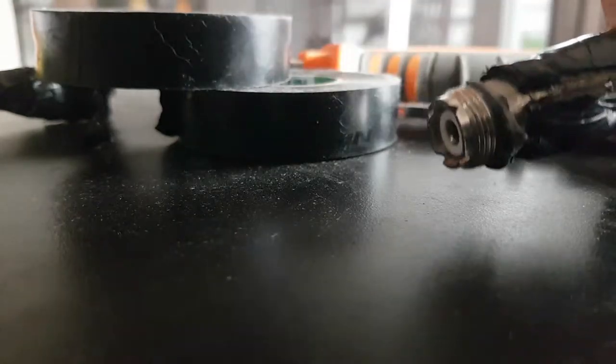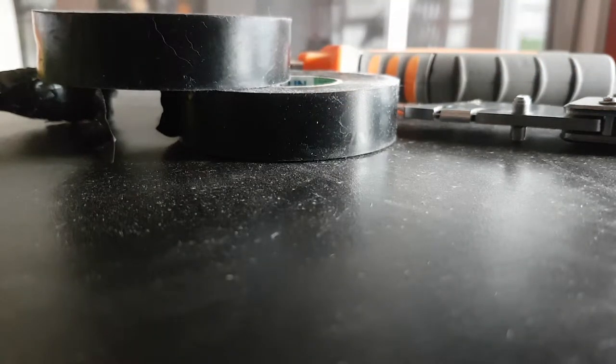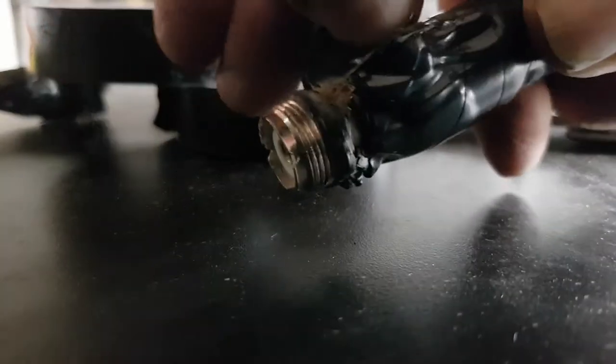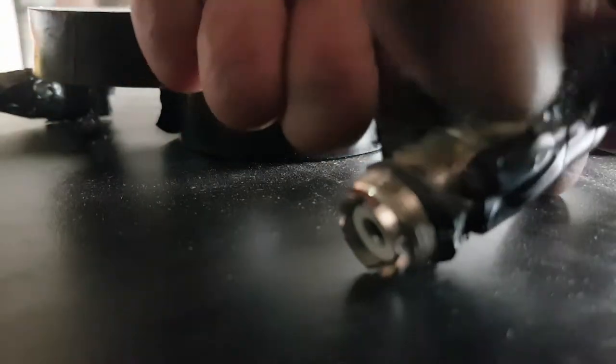Here's a piece of tape that I've taken down. If you notice, it's very, very hard to peel back the outer layer, and if you look in there you'll see where it's all sticky. This is a joining connector - there, it's all sticky. So, very hard to get stuff off, and I doubt you'll ever be able to turn your PL259 again.